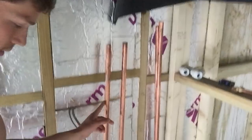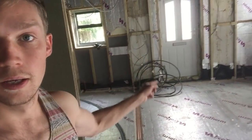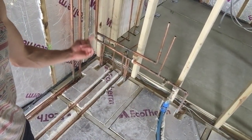My feed comes down on the left from the boiler, goes all the way to the floor, into the groove I've cut out, and then elbows off so it runs straight down the room in a straight line. That lets me put all my connections onto that straight line. I've got two radiators here — one on each side — so I'm splitting off there onto a 15mm pipe. And here I've got a radiator that's going to be in the shower room, feeding 15mm pipe up through the floor.